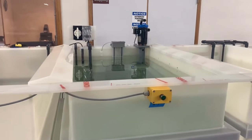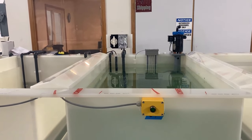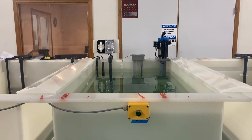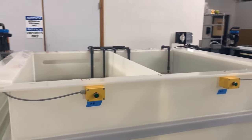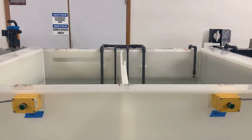The type 2 chem film tank has pH monitoring, heat, and circulation. It's important to monitor pH with regards to this product. We follow type 1 and type 2 chem film with another double cascade rinse tank, again with metered controlled overflow to reduce water consumption but ensure drag-out is minimized.